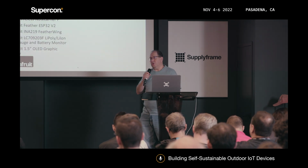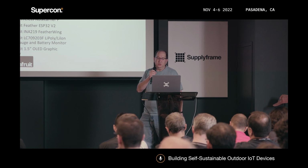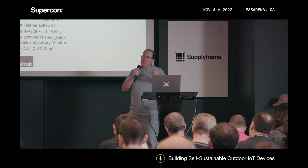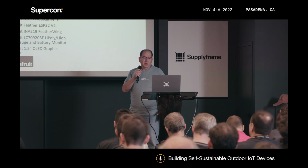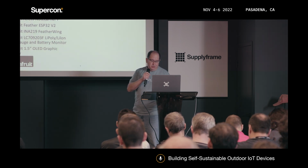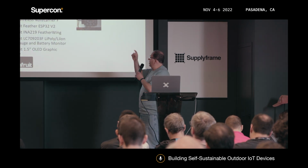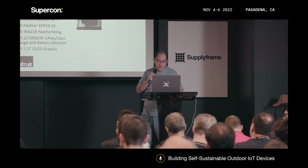So what did we use as the core system to track this information? We used a Blues Wireless Wi-Fi Notecard, from a new company providing a system on a chip that allows you to transmit data through cellular or also through Wi-Fi. In this case, we use their Wi-Fi card. That is the Notecarrier board that they have, and they have an M.2 little chip board that gives you access to Wi-Fi or cellular, depending on which M.2 board you are using.